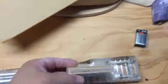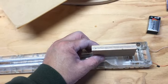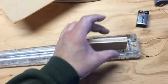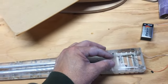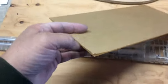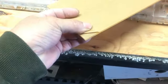So a spline, this is not it, but it goes across the crack and bridges it. So you have all these surfaces that are sort of welded onto the original plastic to strengthen it. And for that, I'm going to be using 1/8 inch plexi or acrylic. So same material as this, I think.